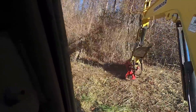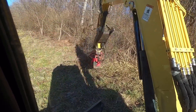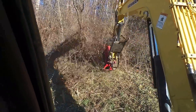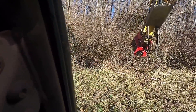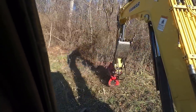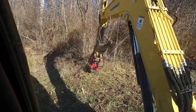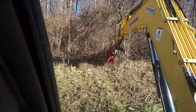These heads aren't loud — I'm just hearing kind of a pushing sound. If you do a lot of heavy brush mowing, this is where it's at. With tall stuff, a rotary cutter doesn't do as good. You've got to kind of start at the top and mow back and forth, or just start at the top and go straight down — I found that worked pretty good with rotaries. This is a drum mower. You'll have a lot of fun running these, again if you keep the teeth sharp. Dull teeth — no fun.